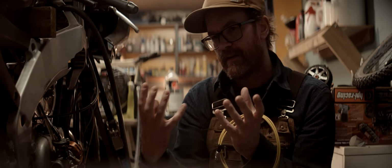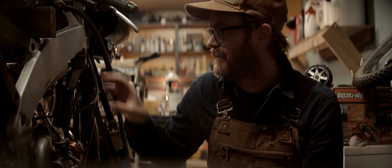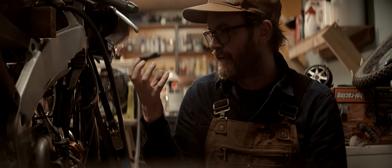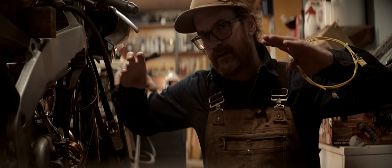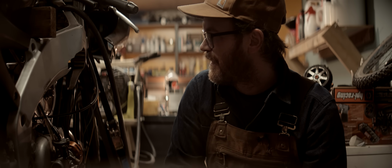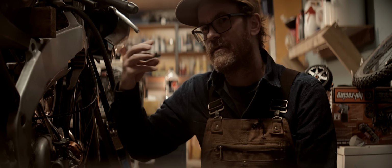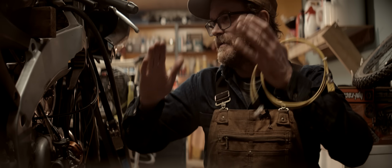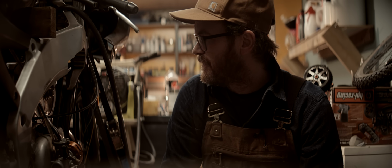That mixture is just being directed directly from the transfers and then into the exhaust port. And it's a possibility with this design where the exhaust port is so large and so wide, and also the transfers are huge, and so the velocities aren't that high, and maybe it's too low. And as soon as the mixture exits the transfer ports, it just flips around and goes out the exhaust. And that in combination with that wrist pin creating communication in the same area between the A transfer and the exhaust port, so double bad, maybe. I can't really find any other explanations for this.